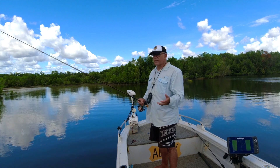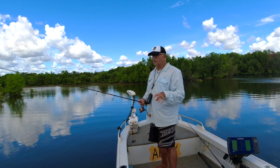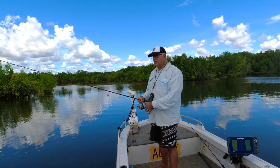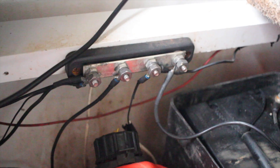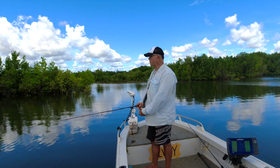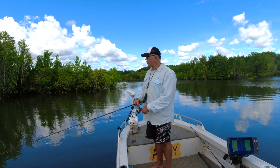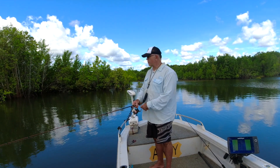When I got the boat and had to set up all the electronics, one thing that drives me crazy is bugs in the electronics, and I use the boat so often — about 3 or 4 times a week seriously. So I gutted it, did all the electronics, and made sure I used really good wiring. I used a bus bar across the back because I've got a single battery to run all the electronics except for the electric motor, and up the front I've got another battery just to run the electric motor. That way I get no interference through the sounder — if I run the electric motor on the same battery as everything else, as soon as I hit the electric motor I get interference on the sounder.